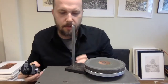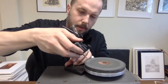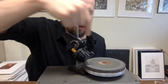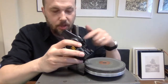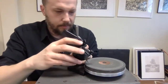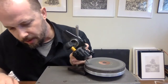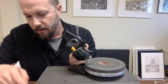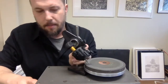We have our machine here with a rod — this goes underneath, put that on top. The graver is pointing in the direction it's going to turn. This machine will turn either way, but in this case I'm going to have it go counterclockwise. There's a little button down here — press the one on the right to make it go counterclockwise; there's a little arrow showing the direction. Turn the machine on first before putting it on.